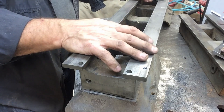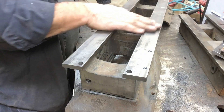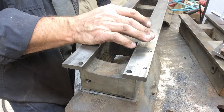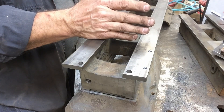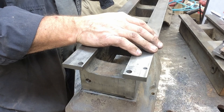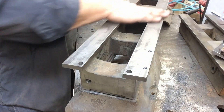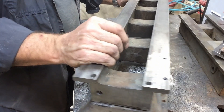Everything that goes back on here as far as the main components are factory Atlas parts. I've got an Atlas turret tailstock that mounts on here, and I've got a couple of production cross slides that I'll put on here. So we're really not going to utilize a lot of things that would be necessary on a standard lathe running a lead screw. Once it's set up for a part and everything's mounted, nothing's actually going to move on the way, so we can compensate for a lot of this wear in the way we set it up. I've got the headstock apart - I may go back and rebabbit the headstock, as it is a babbitt headstock. We'll have to realign the tailstock for this bed and this whole setup. Hopefully it'll inspire people - you can do a lot with a lot of nothing.